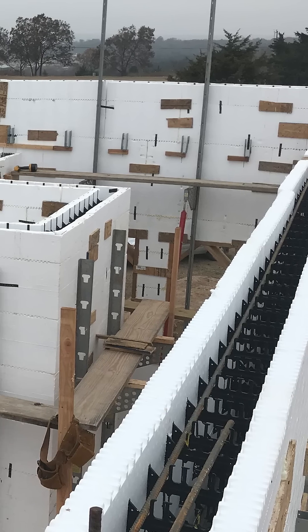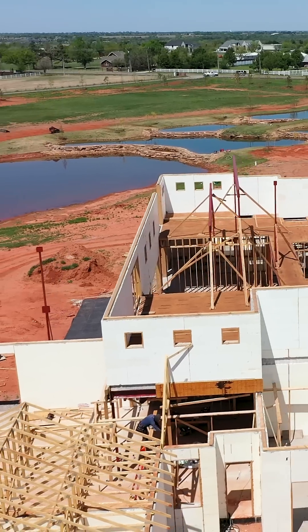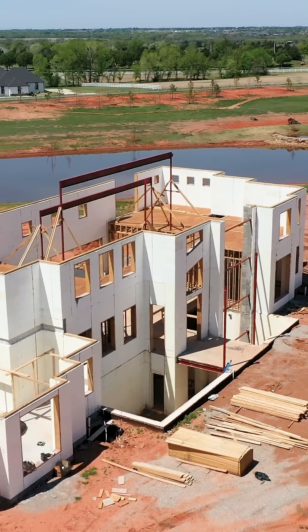At the top of the wall every now and then I will use some foam glue. Six and eight inch cores — usually not necessary — but the larger forms have such a volume of concrete in those 10 and 12 inch forms. When you get to the top of the wall, you've got to watch them; they can get a little light on you.